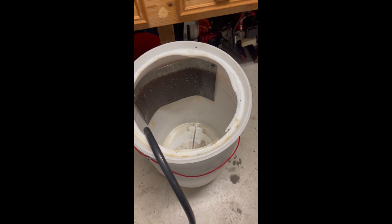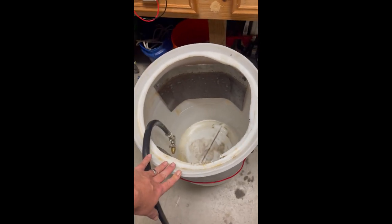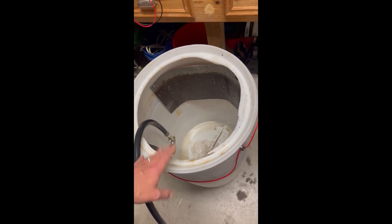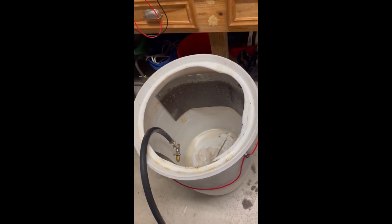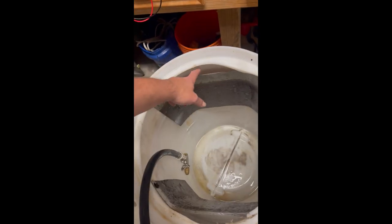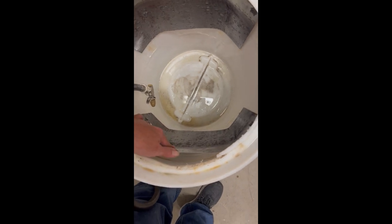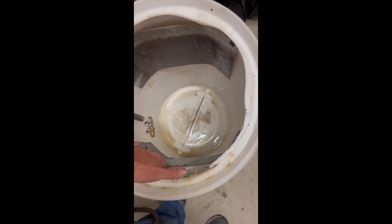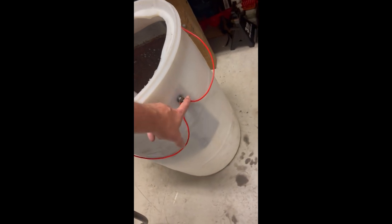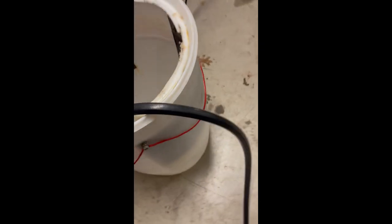Okay, electrolysis tank, they're pretty simple. This tank here was from a car wash. We got it for 10 bucks and was able to just cut a hole in it and add two 16 gauge welding plates inside the tank. And now, after that, of course, here's your bolts all the way around it, and they're all connected with a power wire.